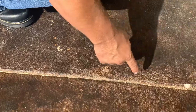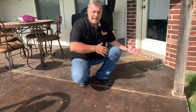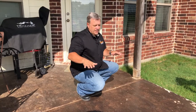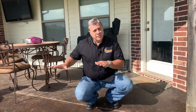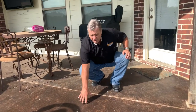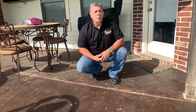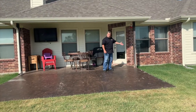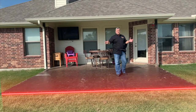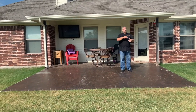Another common question: what do I do about my patios and driveways? You need to be watering those as well. If your patio or driveway has a gap between the house and the concrete, run a soaker hose across that gap about once or twice a month. The concrete acts as an evaporative barrier that helps retain most of the moisture underneath, but it will gradually dry out. Water that gap between the patio and the house foundation — or the driveway and garage foundation — once or twice a month. When bringing your soaker hose up to the patio, take it around the edge of the patio and continue along the house from there.